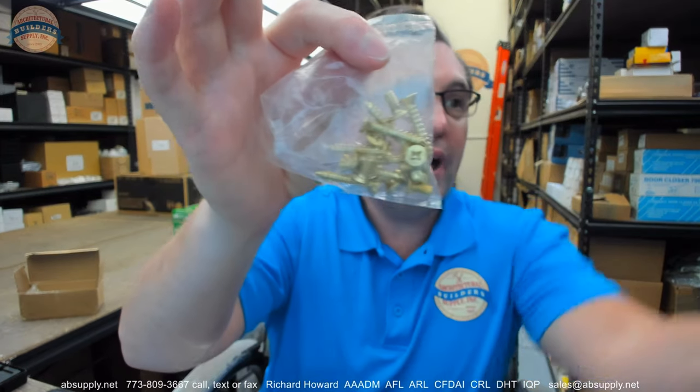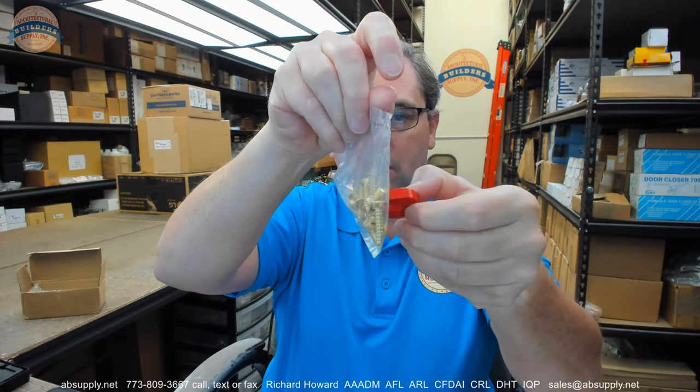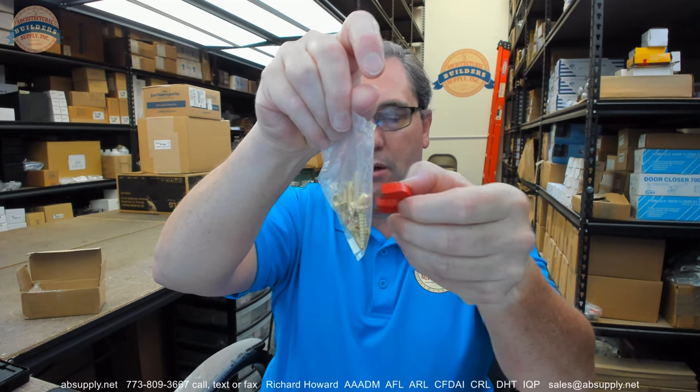Screws are included. These are definitely non-ferrous — I'm going to say these screws are brass. If they were stainless, they might have a small twinge of magnetism. The point of putting a magnet on there is to tell us this is a non-ferrous based material. Brass is a softer metal than steel, so when you're pre-drilling those holes, be sure to drill them the proper size.